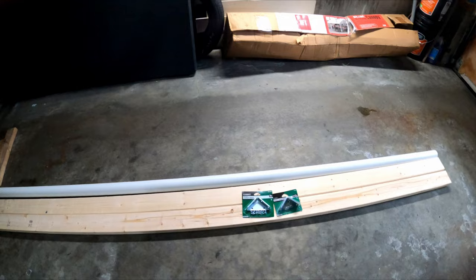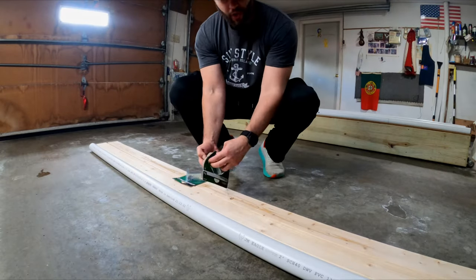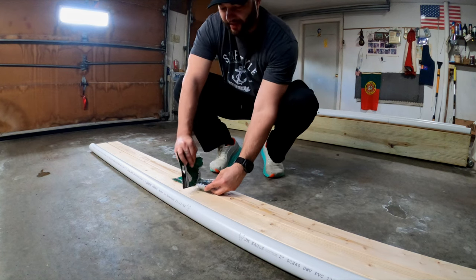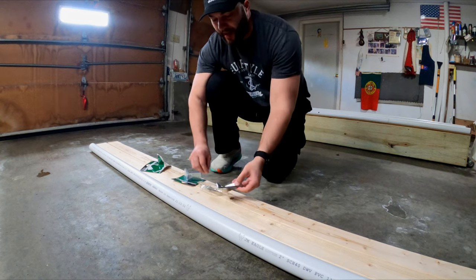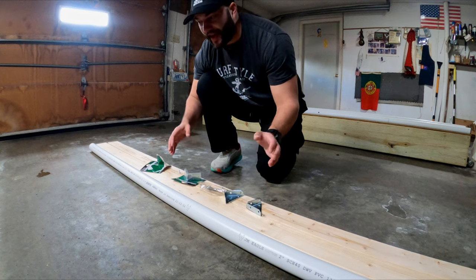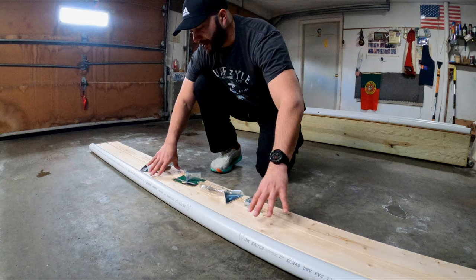The first thing you want to do is put all your braces into one board at once so you can line it up and the other board can just pop right on. The first time I made a p-rail, I made the mistake of screwing in both boards at the same time as I went along, and then it wasn't perfectly square.